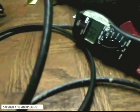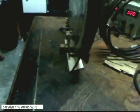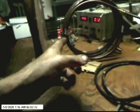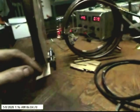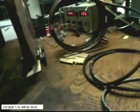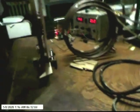got on your machines. I would suggest a clamp on ammeter to see how much current it's pulling. It may take more. That OPA cannot take more than 45 volts. I'm not going to burn the thing up. It's a 1.5 megahertz amp over there. OPA 541 costs about $30-$40.